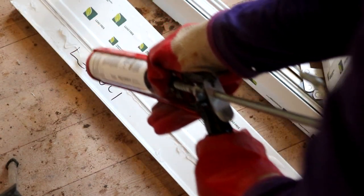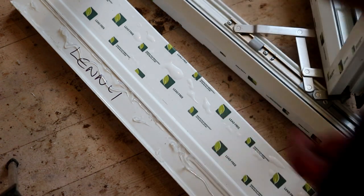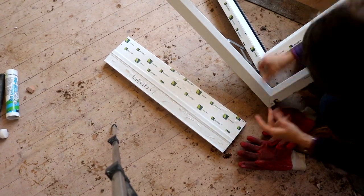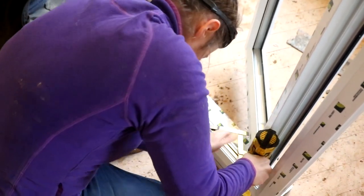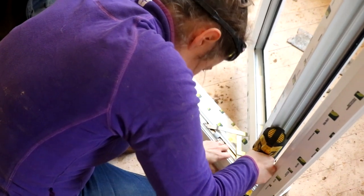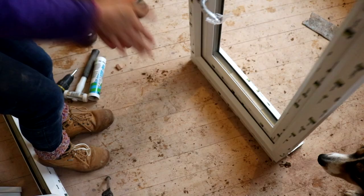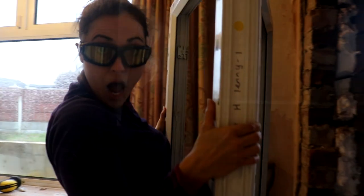Just ignore my wobbly arm — we found the gun was broken so I had to really work hard with it. Now I'm pulling the protective film off the actual window frame so it would be easier later. Then while the window is open, my dad's balancing it so I can screw through the bottom of the window frame to the windowsill section and make sure the screw head isn't in the way so it closes fine.